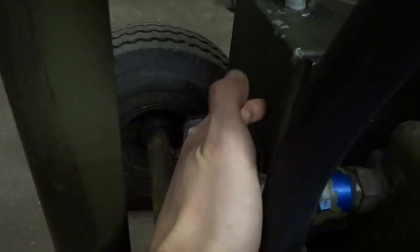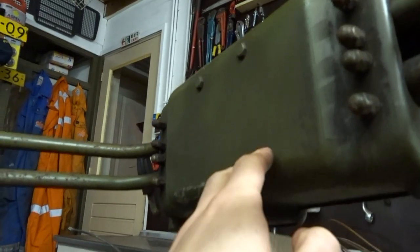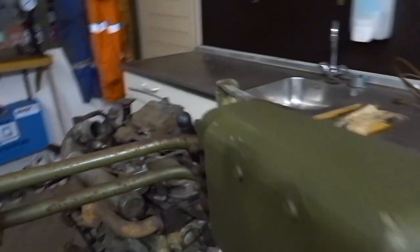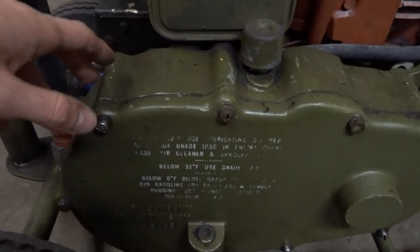This is the suction line from the bottom of the hydraulic storage tank. The pump delivers pressure via the discharge line, going here via a connection, then going to the switch. If you don't activate the switch, the oil goes straight back to the tank. If you activate the switch, the oil flows via the pressure line to the motor, spinning the motor around, then going back via the return line to the tank. So it's all quite simple.